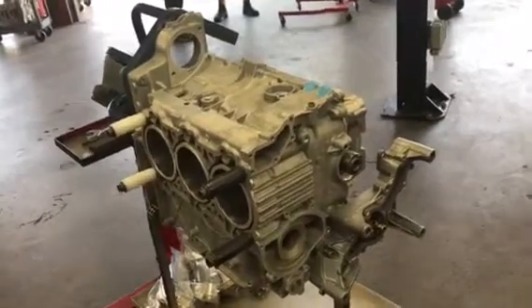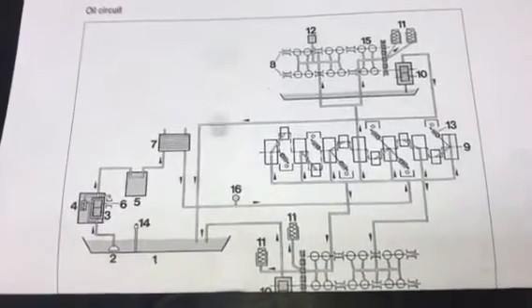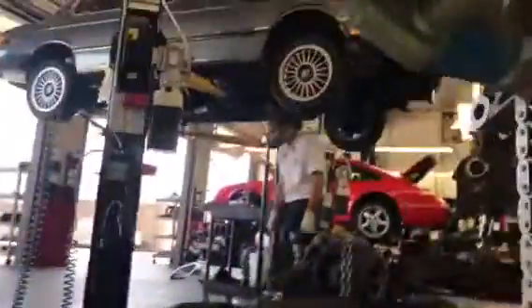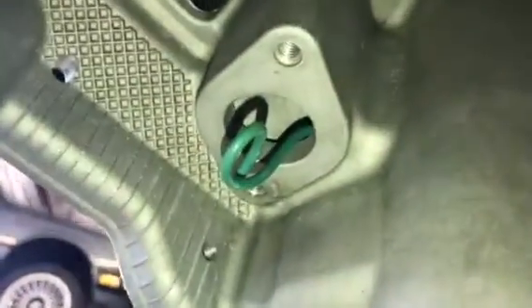Here's a good layout. Porsche gives you a basic layout on paper, but that's difficult to follow. So what we're doing is we're going to watch where it goes. If you watch the green wire, you'll see. If we get up underneath, there's the pickup — we're in the oil sump area. The wire goes inside the engine case over to the oil pump.